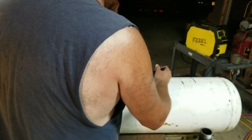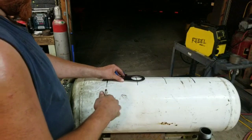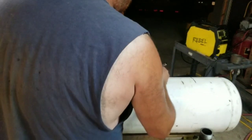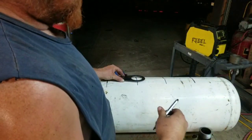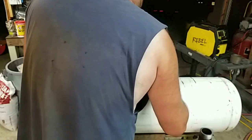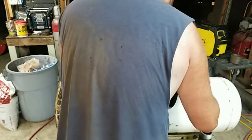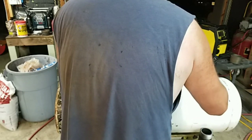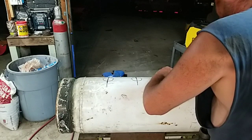When I'm cutting a round tank, I always like to find the seam first. That seam gives me a nice straight line from end to end of the tank, and the seams on the end caps let me measure and get squared up on a round surface. When I built the trommel from an anhydrous tank, I did all my measurements based off the seams. These holes don't have to be perfect — we're not building a piano. At least it's cooler out right now; today was just absolutely wicked.